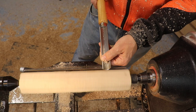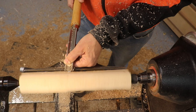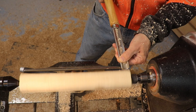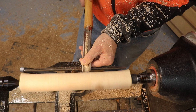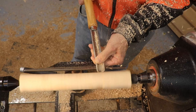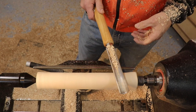When you're just getting started with the roughing gouge, the work is pretty thumpy because you're knocking off corners — you're turning way more air than wood at first. Every time the wood comes around, it's going to thump on the roughing gouge. It has a blunt nose angle, and that's because you want to knock off rather than shear off those corners. If you're shearing at this point, you'll splinter the wood and it gets dangerous — a splinter could lodge in your hand. To check progress, set the gouge on top of the wood and listen for thumps; if it's still thumping, you have more work to do.